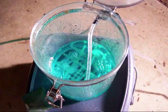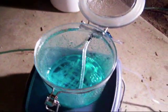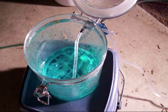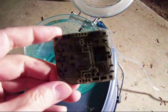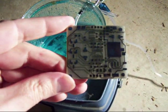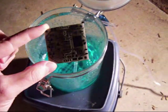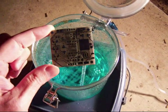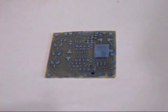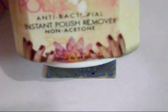Total time: one hour, fourteen minutes. I was able to scrape that final little bit with a pin needle. I think it was caused by a little oxidation on the board — the board is very old, probably fifteen years. I tried to prep the surface as best I could with sandpaper and cleaning it. So there you have it — an etched board. Next we'll go over the cleaning process to remove the toner, verification of the board, and removing the masking. I use a non-acetone fingernail polish remover.